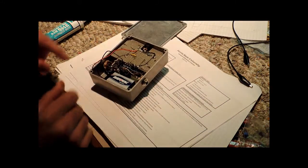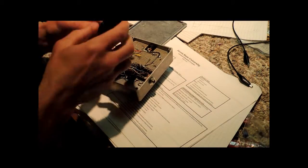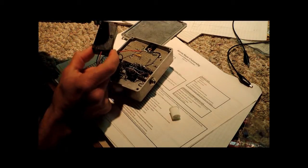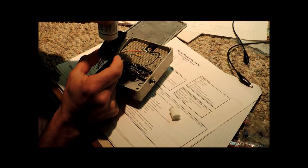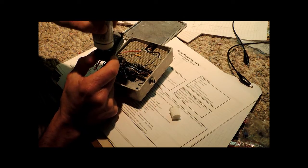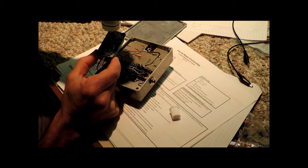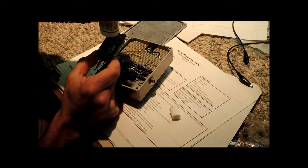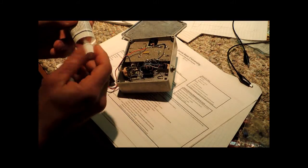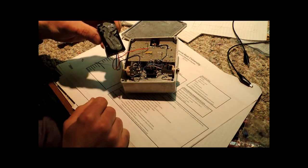And then over here, what I want to do is glue in the battery. So we're going to pull the battery out, the battery holder, I should say. Once again, we're going to put some of the silicone adhesive on the back side of this thing. You can go a little bit more liberally with this one because it's inset, so it has to be thick enough to give that gap enough adhesive to fill in between the standoffs, which you can see right here, and the flat chassis.